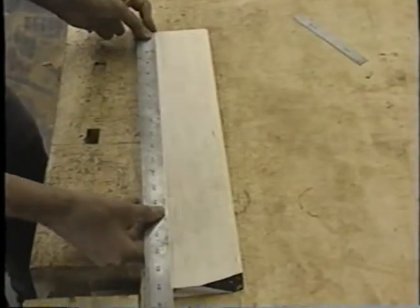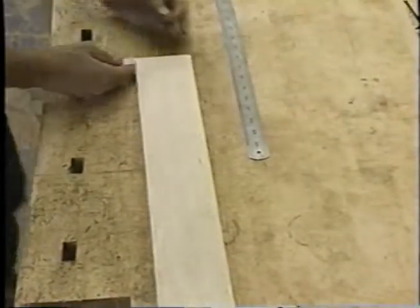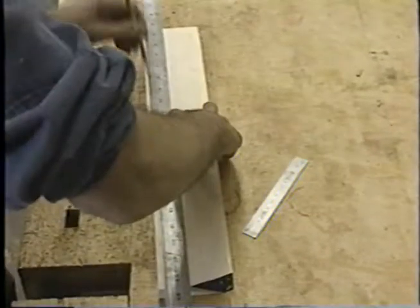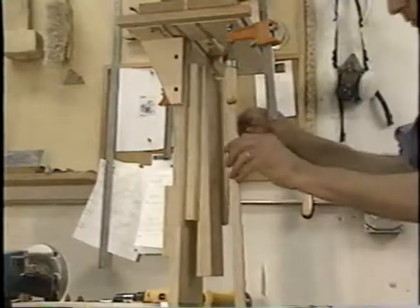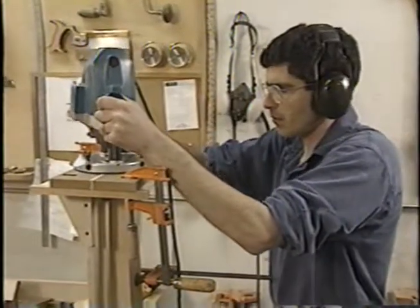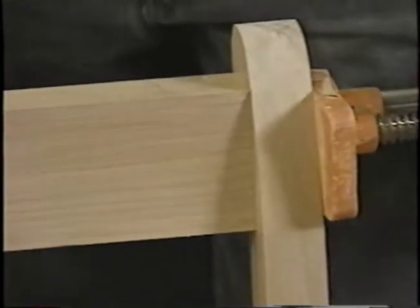1/48 over the 2 3/4 inch width of the slat equals a slope of about 1/8 of an inch over 16 inches. That's the slope of the secondary wedge I'll need to make the rail fit perfectly. I'll cut this out on the bandsaw. The primary wedge goes on the jig first. Then the secondary wedge goes on the side where it's held in place by the blank for the slat. It ain't magic, just good planning and measuring.